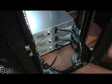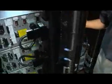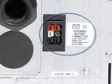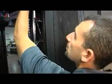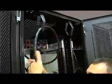First, hook up the EBM cables to the BladeUPS units. Here, we'll be connecting one EBM to each BladeUPS. You can install and connect additional EBMs to further extend battery time, keeping in mind that you need to have an equal number of EBMs connected to each BladeUPS in the system. Install cable management brackets in the cabinets and use them to secure cabling to the UPS.